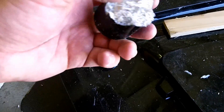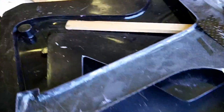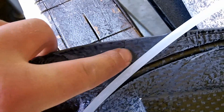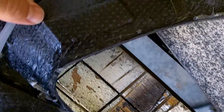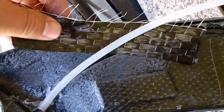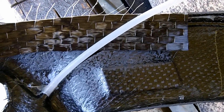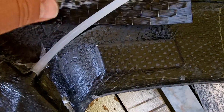I might actually put the resin on here first and shove it down in there. So that's one fix I've got to do. Another thing is when I was pulling this out, this frame was bending up and it cracked right here along the edge. You can't see it real great, a little bit better on this other side. The crack doesn't go all the way across, which is good, but I do need to repair that. The way I'm going to repair that is with this uni — I'll cut it, shove it in there, probably do two or three layers, and then I'll just vacuum bag it. That'll cover that crack up pretty good.